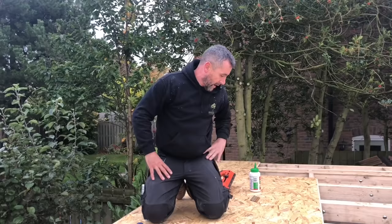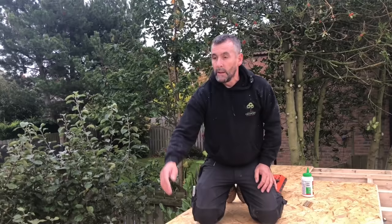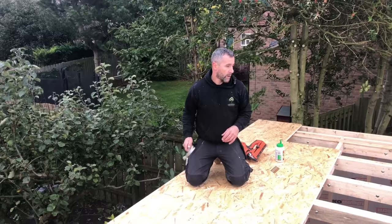Writing goes down on these. The writing goes down for the reason, so if you were doing it and it was under building control, then the building inspector would be able to see if you used the right quality boards. So board, off cut from there, we'll go there, just like fitting a laminate floor, and just keep going that way until we get to that end. Okay, so if you keep watching, I'll show you the roof finished, and hopefully by that time, John will have turned up with the rubber and we can get it protected in case any rain does come.